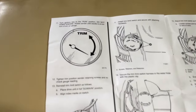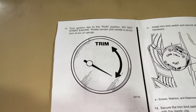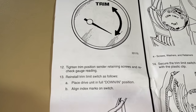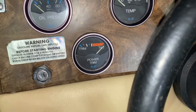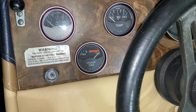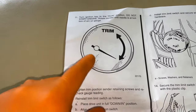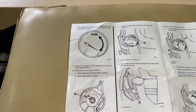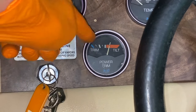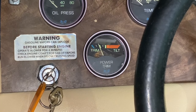Back inside the boat to the instruction manual — we're on step 11: turn the ignition key to the run position, do not start the engine. Rotate the sender until the needle is at the bottom of the arc on the gauge. Step 12: tighten the trim position sender retaining screws and recheck the gauge reading. The gauge we're referencing is the power trim gauge. We need to rotate the sender until that needle is in the full tilt-down position. Right now it's more toward trim as opposed to the lower tilt, so we'll go back out and rotate the sender switch until the needle goes all the way to the tilt low position.